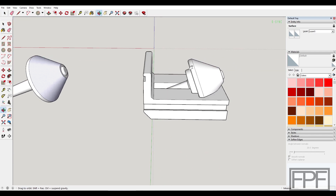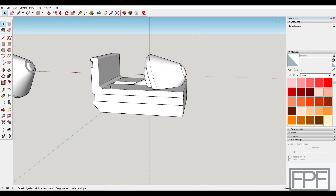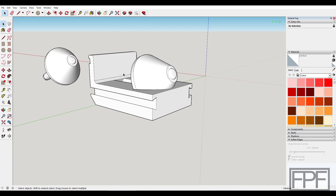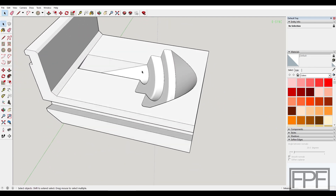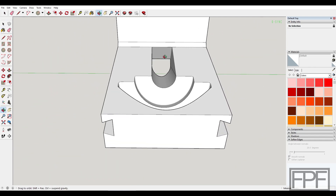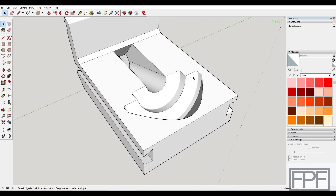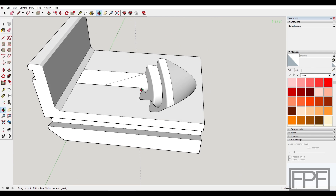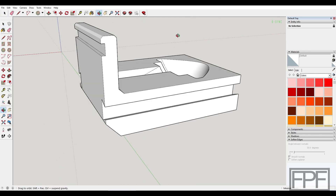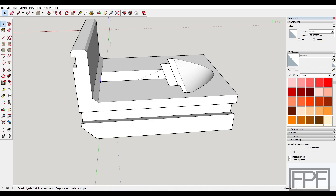I took this geometry and duplicated it, creating an extended and elongated version of the geometry from last week's design for each module. I flattened out the top, got rid of the entry point for the taper, and then basically subtracted the geometry from this chunk of material. For the taper I opened it up at the top and made this section not really tapered — so the taper gets thinner down here but this is still wide open. That way there's plenty of room to drop it in without having to line up both ends simultaneously; you can drop it in and rotate it into place in one smooth motion.